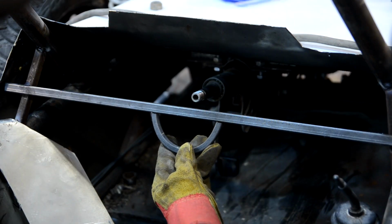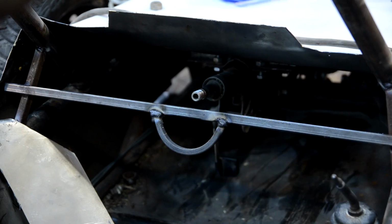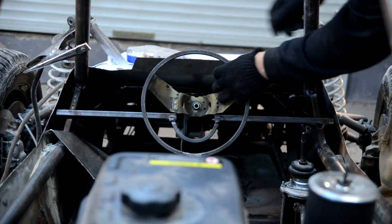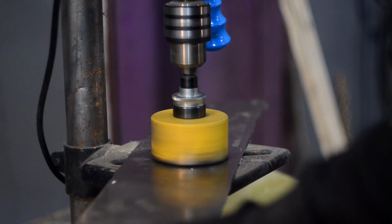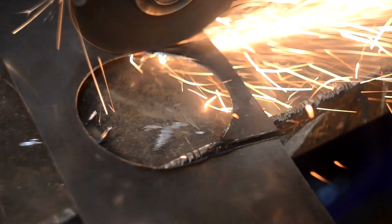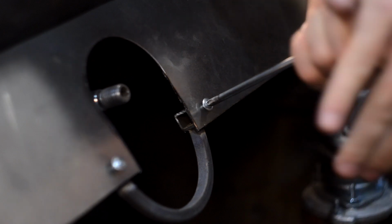The crossbar prevents the adjustment of the vertical wheel position. We need to cut out a part from it under the wheel and weld it back through a clamp. Thus the wheel adjustment will remain and the wheel won't touch the bases and the panel. I cut out a hole in the panel under the wheel too. The panel will be fastened with self-tapping screws.